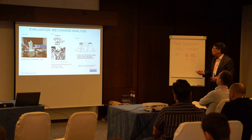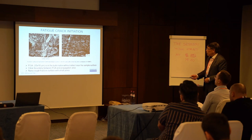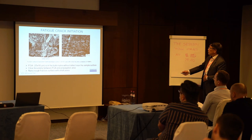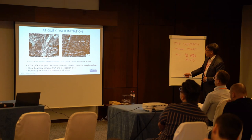As I said, we tested 10 samples and found the same result in each example: crack initiation in the matrix. We can see the crack initiation here — it's quite near the surface. But as I said, there is no defect. When we enlarge this part, we see this type of macro structure with a fine grain area and a lot of dislocations. The surface is also quite similar, with less surface inclusion.